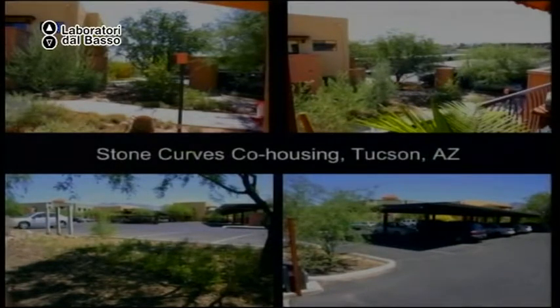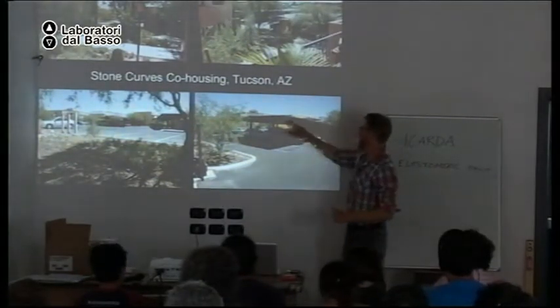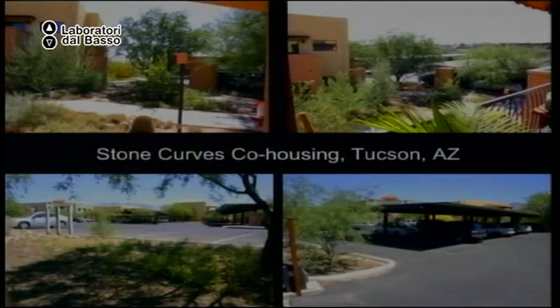And on the carport roof, here's the carport. We put gutters that slope this way. The land is sloping this way, the gutter is sloping this way. So we direct the gutter water to the high point of the landscape, which is here. And the ridge line is there. So the parking lot goes this way, the landscape this way. This water used to be a problem for here. Now it's a resource for here. Is that clear?